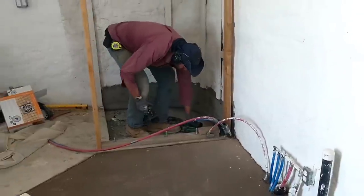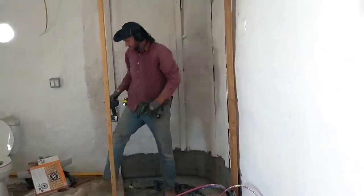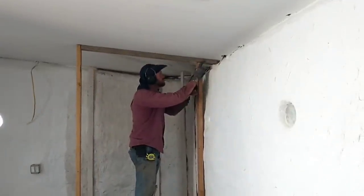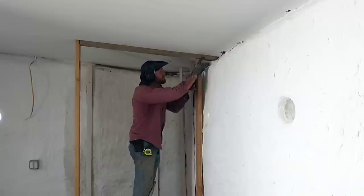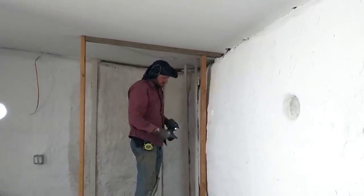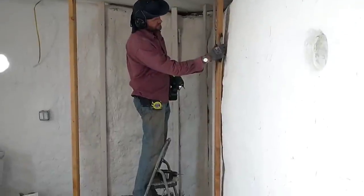This little section wall is also a little tricky, because the roof is angled, and so that top plate follows the pitch of the roof — or the ceiling — that I'm attaching to. That's why I put the top plate and the bottom plate in first, and then I just cut each stud to the appropriate height, because each one will be different.